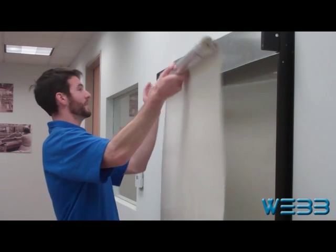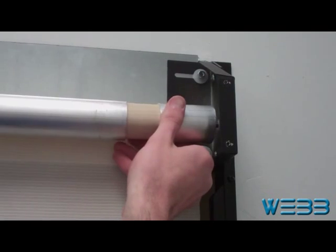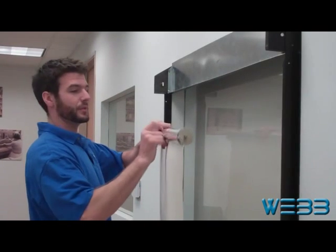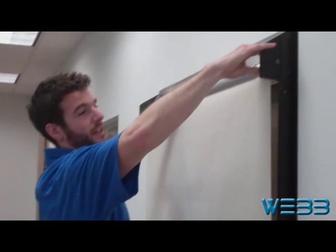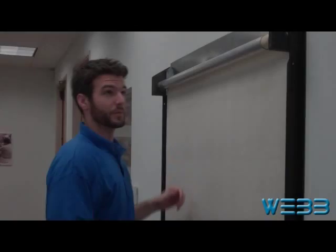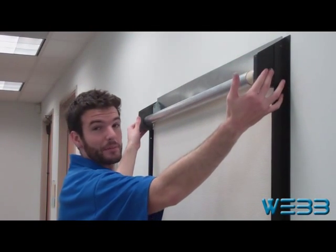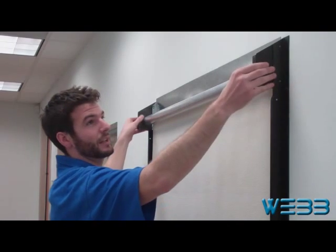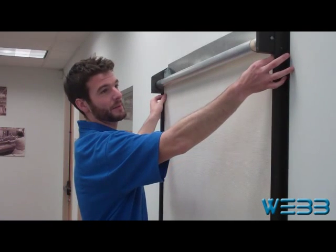What we can do is fit this drive pin directly into the slot. Now that the drive pin is in place, we slide the extender over into here. Another option rather than having the tension pin facing down is to roll the shade over so the tension pin is facing up, then fit the drive pin into the slot and slide the extender over into the hole. With the roller tube fully extended, make sure that there's nothing sticking out past the bracket plate — just slide it in and make sure everything is flush. With the roller tube in place, the next step is to adjust the shade to make sure it is centered in the opening by grabbing it and pulling it from side to side.